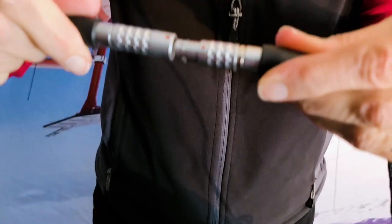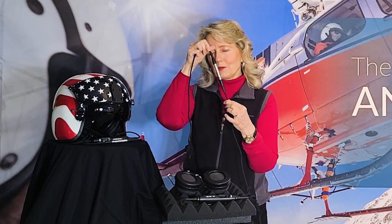The third part of the system is the wiring harness. This goes into the helmet under the liner, attaches the boom microphone, exits the helmet, and connects to your control box. It has a really beautiful quick-disconnect connector on one end that connects into the piece on the control box. This connector is probably one of the best features of the whole system — it has about a 10-pound pull force. So in an emergency egress situation, this will just pull apart, allowing you and the helmet to egress safely while the connector stays in the aircraft.